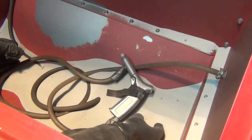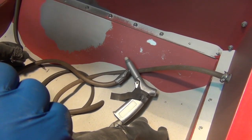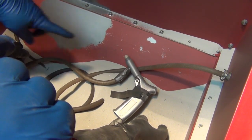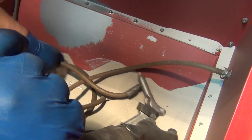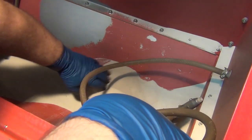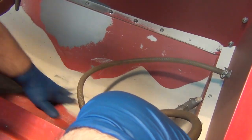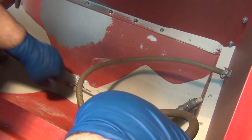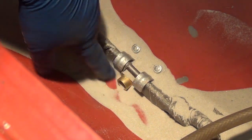Inside, it's just a siphon feed sandblaster with the trigger pulled, taped. And I do have it modified. You see the hose running over on the side here? Let's dig down here a bit. I did this to a couple of bucket feed sandblasters years ago. It worked really well. I've done it to this, and it works really well. Basically, I've just got an air fitting here, just a T.